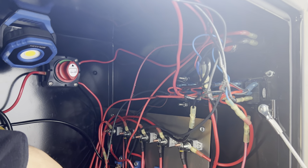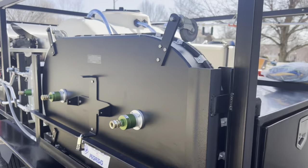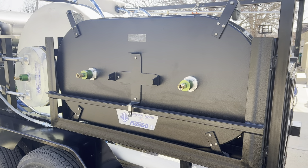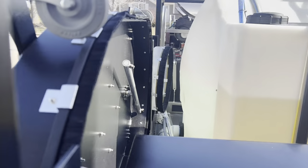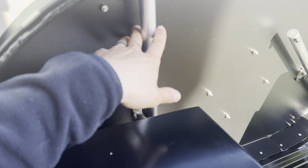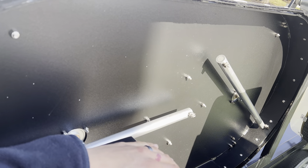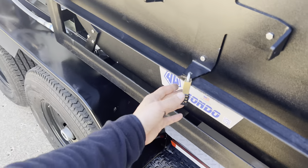My electrical has negative and positive bus bars, self-resetting breakers for my reels and pump, and switches for all the lighting. Moving to the side, I have a 48/49-inch Mondo surface cleaner — a four-foot unit that I love. It's powered by the siamese setup for 20 gallons a minute and currently has 2504 tips installed.